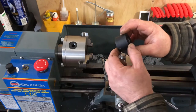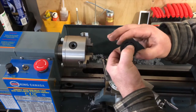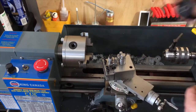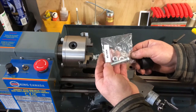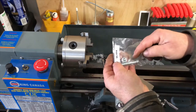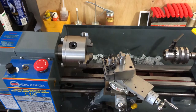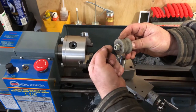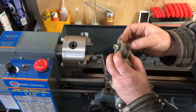These new ones actually have rubber seals and bearings inside, so there's a little drag from the rubber seal. You also get a new bolt and washer that passes through. What I have to do to fit this into my frame is basically build the shoulder and collar — I'll probably make those out of aluminum. I don't need the whole long part; I can just part it off right behind the shoulder.